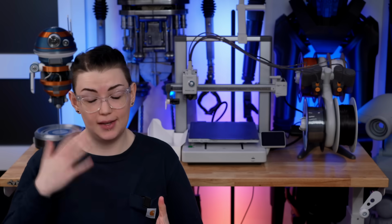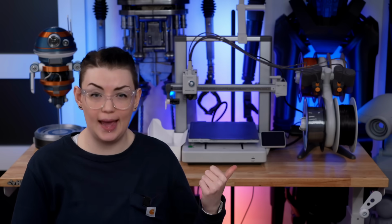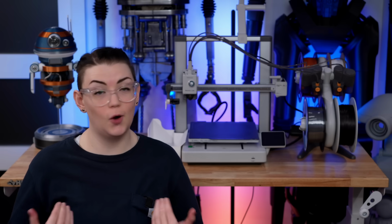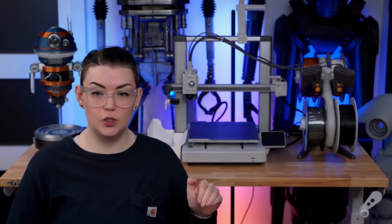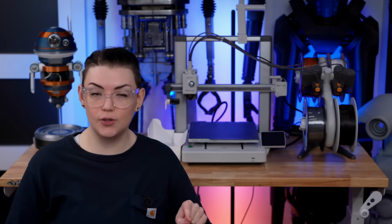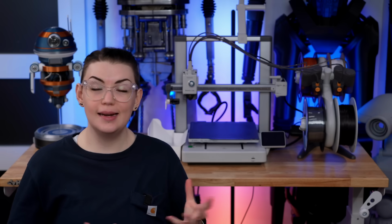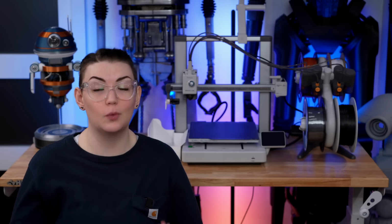On the same topic of waste, now that I've thought about it, the only other slicer setting that I changed was the multiplier setting for the color change for the AMS. As a default, it is set to 1, which is pretty universally considered overkill in terms of filament color change. I believe I originally set it to 0.6 and then decreased it to 0.5 and never had any issue in terms of color bleed. Again, that's a pretty easy setting tweak. It is not the difference between a successful and failed print though, it's just saving you on the amount of wasted filament, which of course is a very important thing to consider.